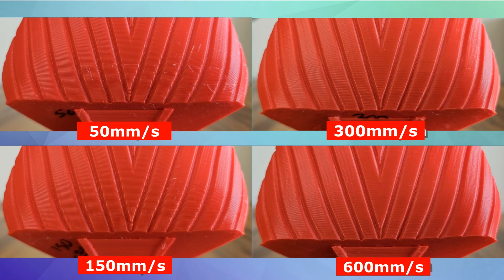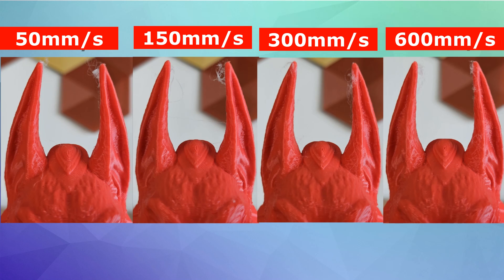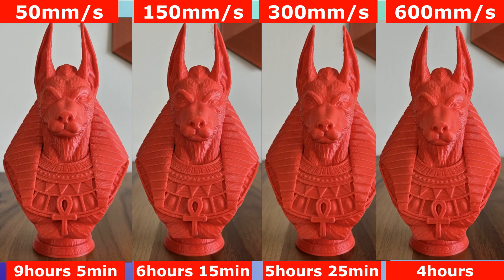There are some changes at the back. As speed increases, steep angle sagging increases. Although there isn't a significant sagging problem, there have been slight fluctuations at 50 and 150 mm/s and the lines are more pronounced, while at 300 and 600 mm/s the surface actually looks smoother. I didn't see any vibration effect at 50 and 150 mm/s. At 300 and 600 it is slightly noticeable, but I can't say there's a clear difference between these two. In areas that form a right angle, like the lower part of the chin, there hasn't been the slightest sag at any speed. The ears have come out sharp and clear in all of them with absolutely no distortion. There wasn't any stringing, but there are indeed very few fringes. Overall, it was a pretty successful speed test.